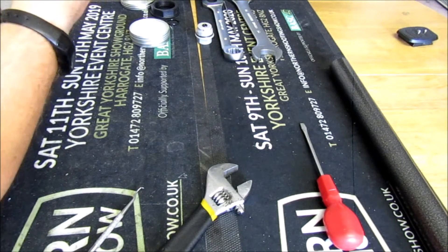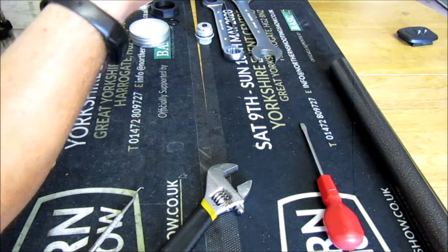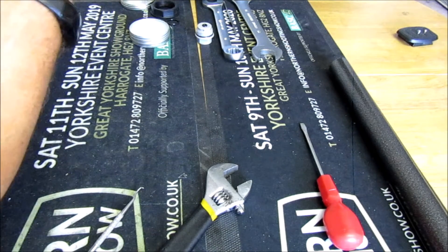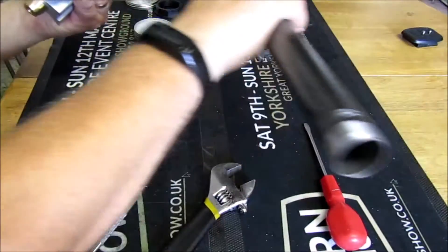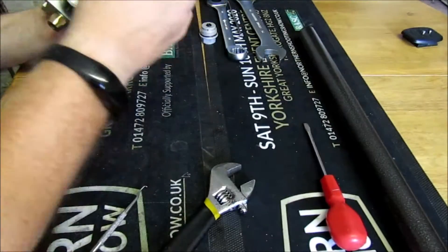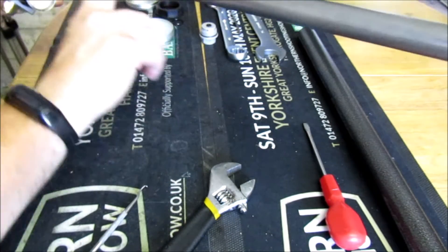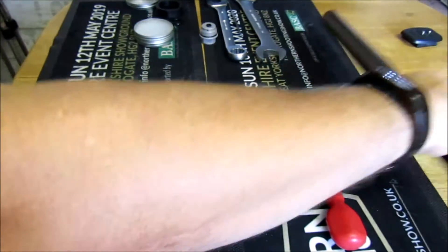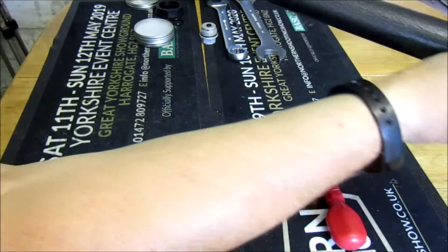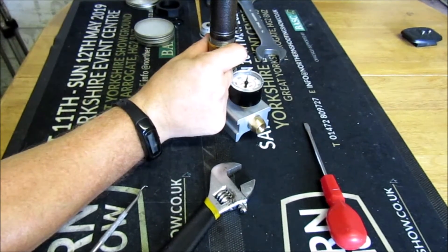Inside here — I know I haven't taken it off — there's an O-ring in the bottom and an O-ring halfway up. The bottom O-ring seals against this tube, and the O-ring inside, right down at the bottom, seals on the bottom of this. Now that that bit is back together, apply a little bit of silicon grease onto the tube, then slide down the outer tube which drops on top like that. Give it a twist and that will screw into the bottom.